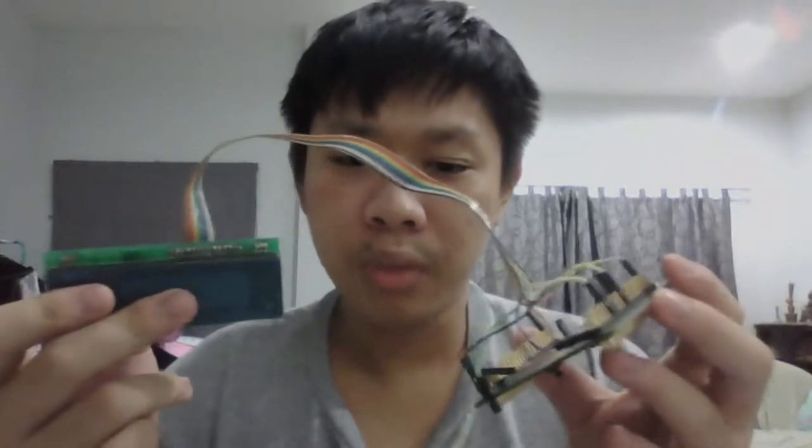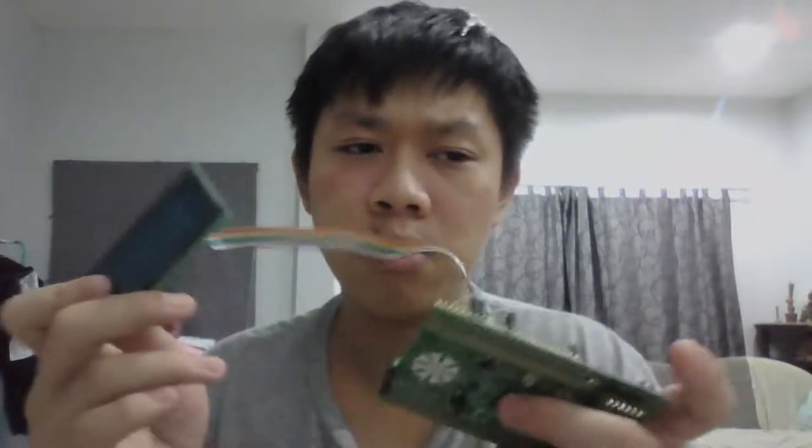For some reason, if I put a single bit stream into a single channel, like the SPI I'm currently using, I'm not sure, SPI2 I believe, and just blast all the data into serial input number one of this display, it's going to display everything just fine. But I just lost the grayscale feature. And there are two things that I need to test out about this thing.